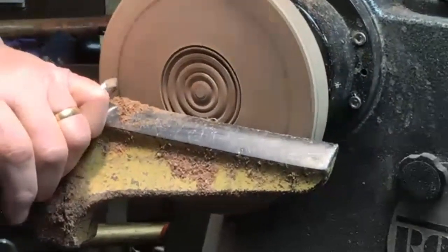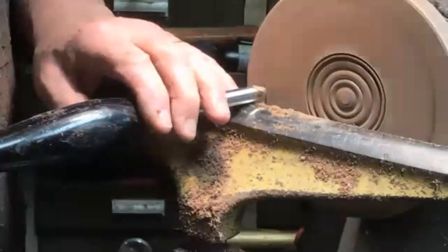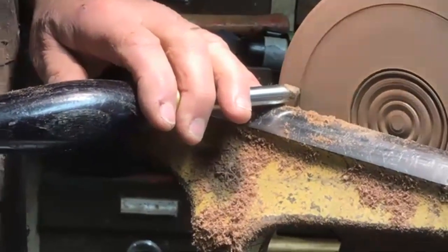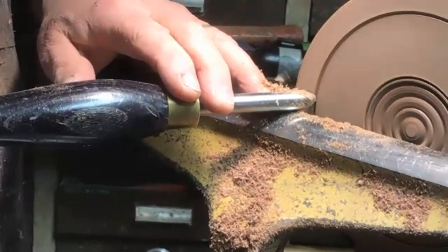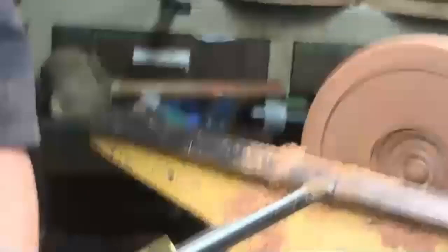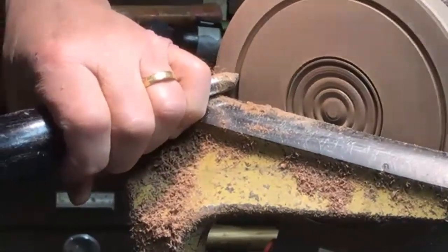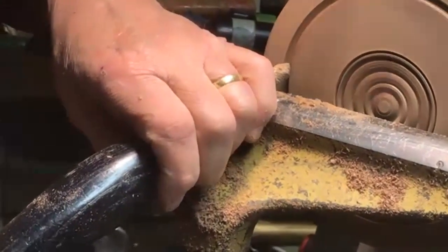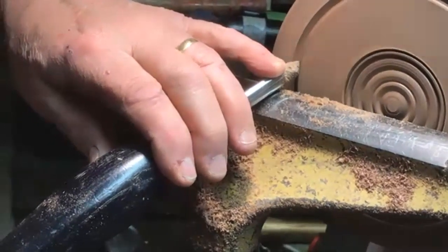Here's that piercing cut again. I could do this with the tool at midpoint and just turn the whole tool over and push in right here. The flute is at nine o'clock and I'm just cutting into the wood. I'm looking at that thinking it's a little bit large, so I'll come back. There's my point - now I'm going to roll that half bead. I forgot to turn my speed back up - turning the bead is easier with a little more speed; there's not quite as much resistance.